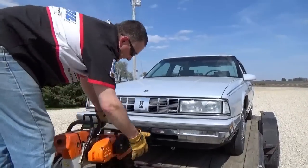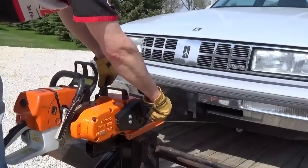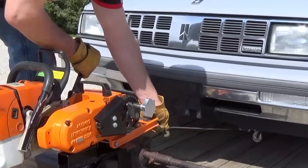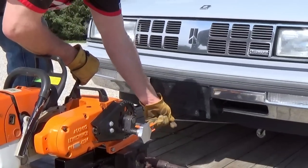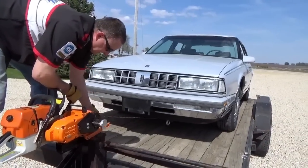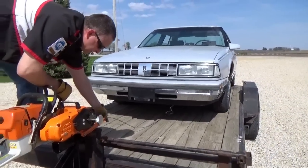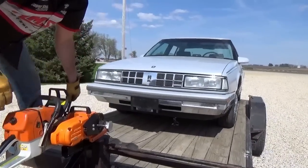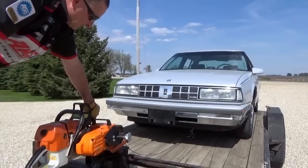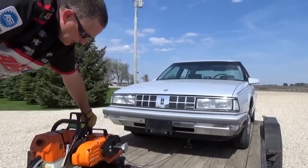Then to release it, kick it in like so, and that'll release the cable. Now I've got it held by the drum, but still it can go backward a little bit. The brake is pretty substantial on that; it'll hold a lot of weight, and that kind of gives you an overview of the Lewis winch, and at least in this job.